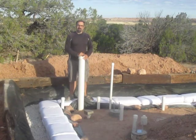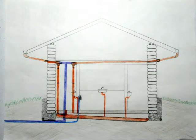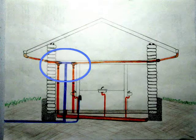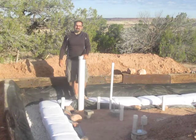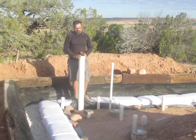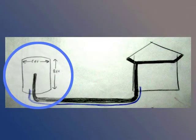This is what I've completed so far of the rainwater harvesting system. The rainwater will fall on the roof and flow to the sides where the downspouts will bring it in here. There's going to be a first flush diverter for each downspout that takes the first 50 gallons of water and washes it down to the normal drain — on both sides. That keeps dust, dirt, and bird droppings from getting into the cistern. After the first 50 gallons has been flushed, the water will start to flow down this main downspout.